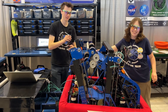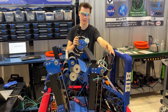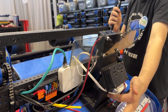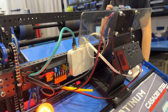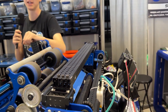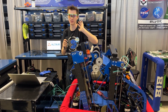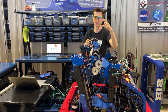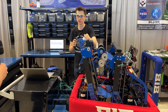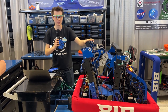Noah, why don't you take us through some of the programming on the robot? On the programming side, the biggest deal is these Limelights. We have a Limelight 2 Plus down here and a Limelight 3 right here. We also had a mount here — the 3 was originally on the bottom side because our goal is to do object detection during auto, which is still on the table if we make Worlds. For now, the 3 is up here as the best camera, looking at the AprilTag while shooting. We do have aimbot — from anywhere along the wing line, podium and over, we can hit a shot. We use aimbot in auto and our sweet spot is shooting under the chain, but we can shoot pretty much anywhere during auto and teleop using that same process.